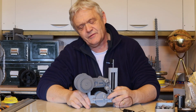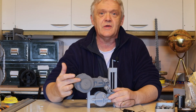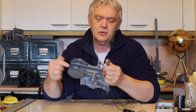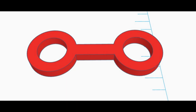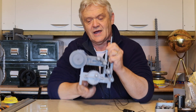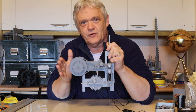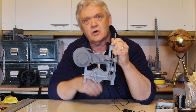With both sides of the ratchet slotted together, research has shown that two ratchets like this actually approximate true rotation — which is pretty cool. The output gear is right there for interfacing with something else; the drive cog goes across both of those. I've put an arm here to bring the pivot point out so I can put this linkage in, linking the pivoting arms to the ratchet mechanism. When I move that and turn this, we get rotation here, and moving that arm up changes the force and torque at the output — and that arm can be moved while it spins.